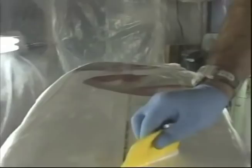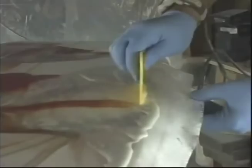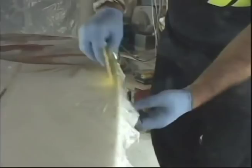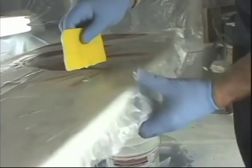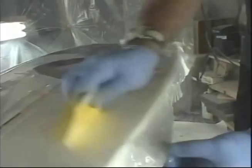Move all your resin to the side, make sure it's soaked through and bring it over the edge. You want to soak the edges as well. Let it drip off. You have to work quickly — though I remember when I first started doing this, I worked a little too quickly. With epoxy you've got about a half an hour under normal conditions. Polyester may be a little faster.